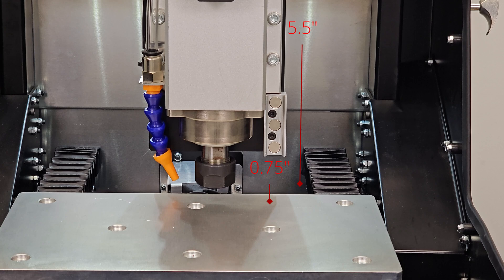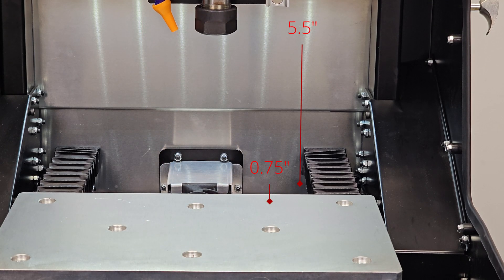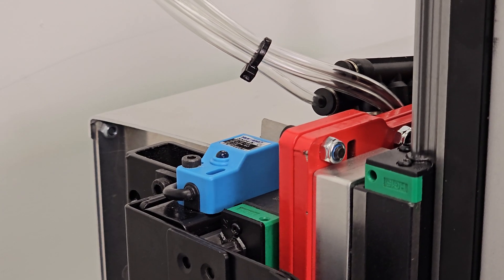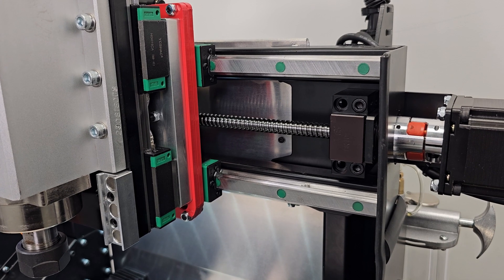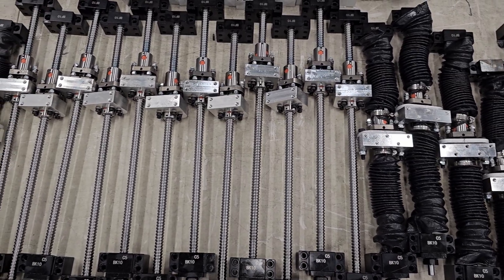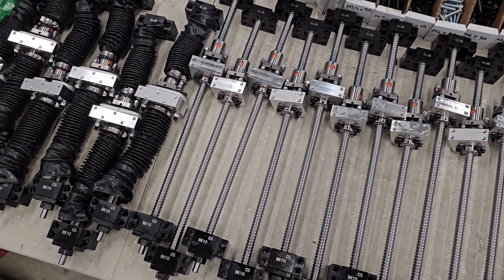Note that the z-axis travel ends about 0.75 inches above the top of the bed, so at maximum z-height you have about 6.75 inches of total internal space. Each axis has inductive end stop sensors for repeatable and accurate homing, and each axis rides on thick 15 millimeter guide rails. All three axes have 12 millimeter ball screws, with the x and y axes having dual spring-loaded ball nuts to eliminate any potential mechanical backlash.